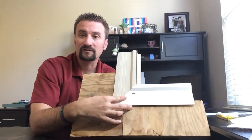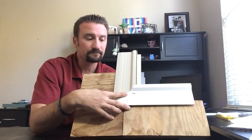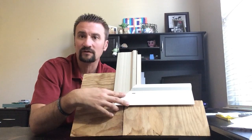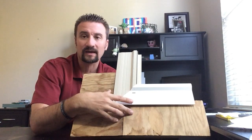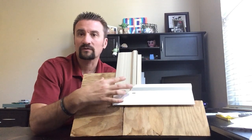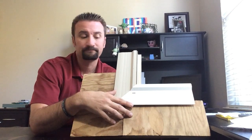So a couple things you want to ask a contractor when you are getting windows is, one, what kind of installation method? Two, what's the condition of your siding now? Are you going to have to replace your siding in 2 years, 3 years, 5 years? In our opinion, it's best, instead of doing windows first and siding second, to do them both together. Meaning if you have to do one or two walls at a time, do it with siding and windows together so that you can get the proper method and a watertight seal, and you have one company that can guarantee the entire wall.